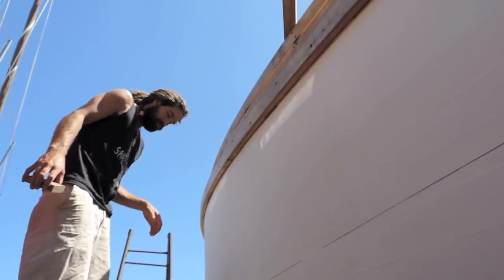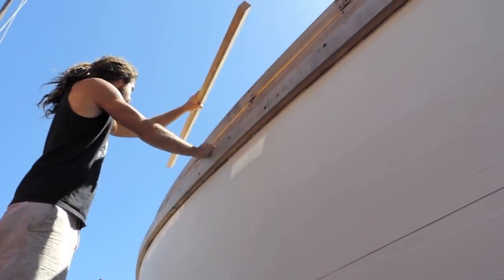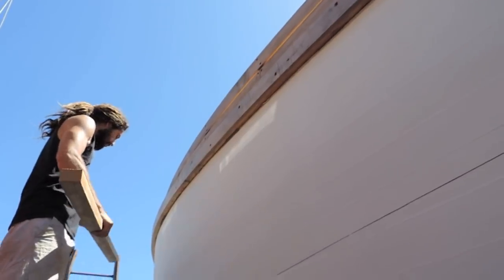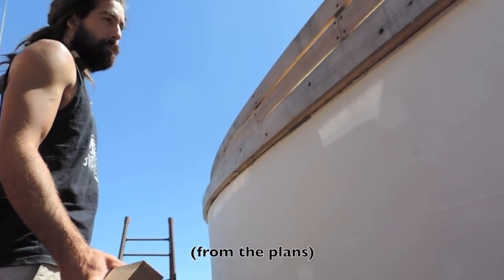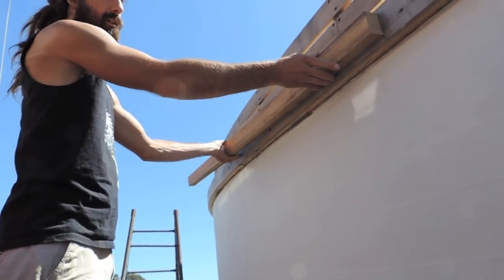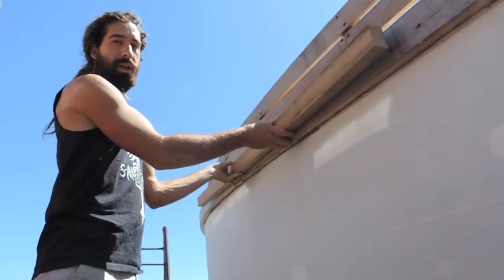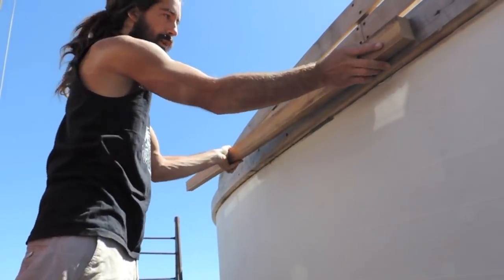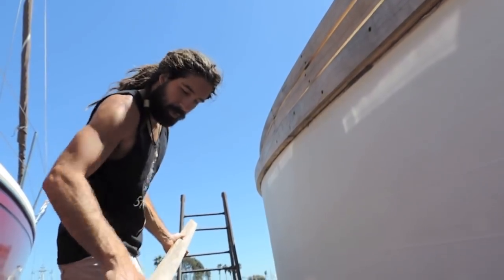So yeah, that's nice. We're doing our channels out of three layers, and this is two by stock. Find out where the chain plates go, and then we take this and just screw it right in and bend it in place as we screw it in. Once we get it dry fit, we pull it back off, smear a bunch of tar, and then screw it back in its holes that we already did. But it's a pretty easy process.